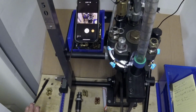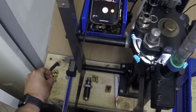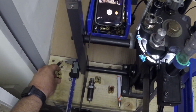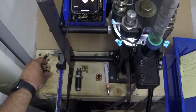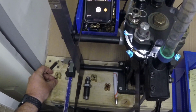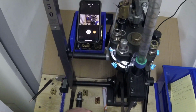I've seen it with a few different types of brass. Some brass is stronger than others. Just in the past, I've noticed that Federal brass is not quite as durable or as strong as, let's say, Winchester brass is. And that could change, as manufacturers change who they're ordering their components from. If you're paying for cheaper materials, I understand it's a business, but at the same time, we, the end consumers, kind of pay the price. So like I said, I tend to find that Federal brass seems to be a little bit softer. Anyway, how can you address bullet setback?